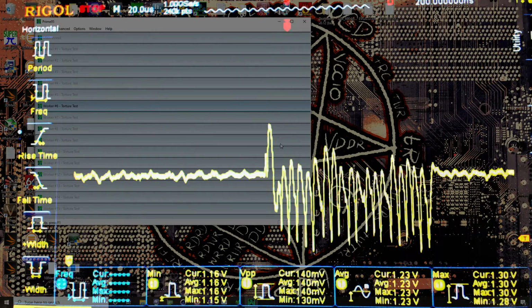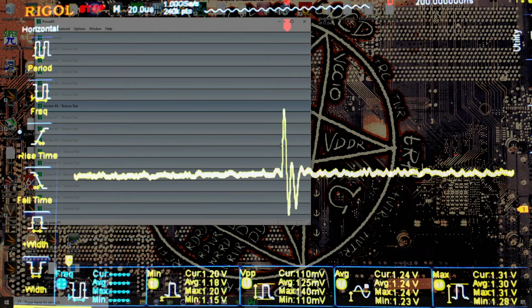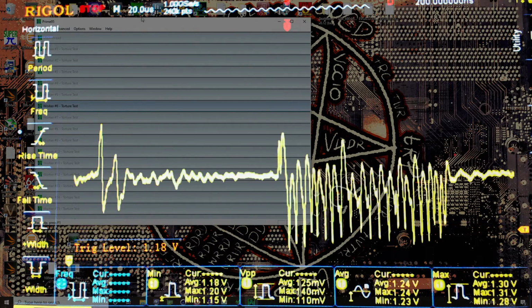So that is a mouse input spike, because for comparison, this is what happens without moving the mouse, is just that. And that's just the Windows event timer. So you always get these interrupts in any workload that's running, where Windows is just checking that nothing has stalled out on the system. Anyway, if we pull this down a bit, set it to single, I move the mouse around, and we get this horrible mess. And the start of this horrible mess is basically Prime 95 getting stopped.